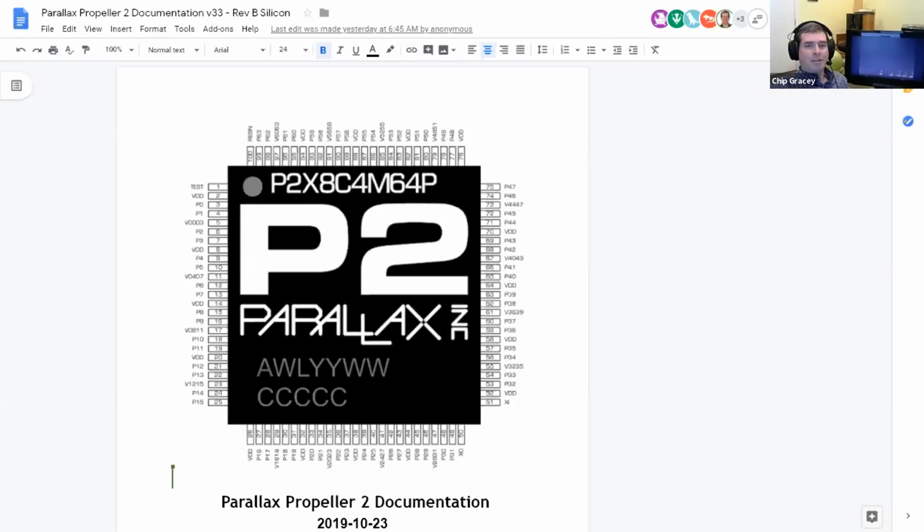This chip was actually really way over designed. We thought it was going to take about 2.5 watts. So it has a massive power grid on the chip, and then every 4 IOs have their own power supply, and there are 4 VDD inputs per side of the chip. So there are 16 total VDD inputs. Internally on the die, jumping to the lower ground pad, there are 16 VSS connections, which go to ground, and then there are also 16 GIO connections, which feed the IO pins.